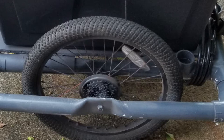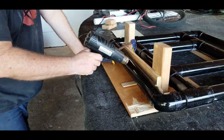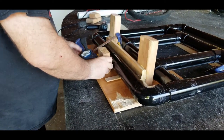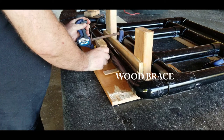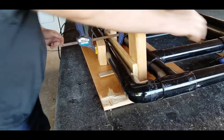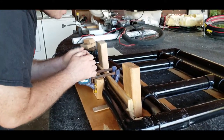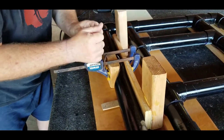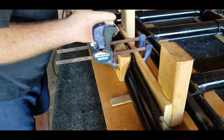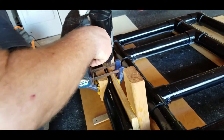The next step is to create flat areas on the PVC pipe so that we can attach the wheels. To do this we've got to heat up the plastic and bend it using a heat gun. Get the plastic nice and warm but don't burn it — you want it to the point where it starts to be flexible. I use a wood brace in the back and a little wood block in the front to set the size of the indentation I want to create, then clamp it and squeeze the pipe. Keep moving it in until you get that nice compressed flat. Both sides of the PVC pipe will come into contact with each other and almost fuse together, creating an area that's twice the thickness of the normal PVC wall. Use the heat gun to keep the area warm while squeezing it as much as possible, then let it cool down.